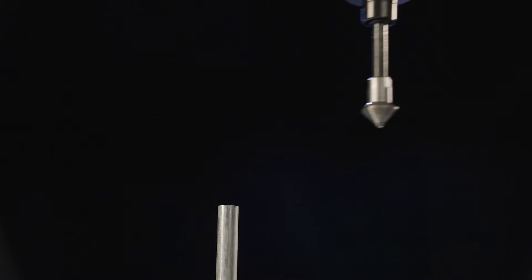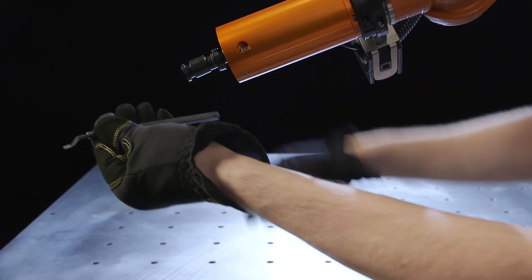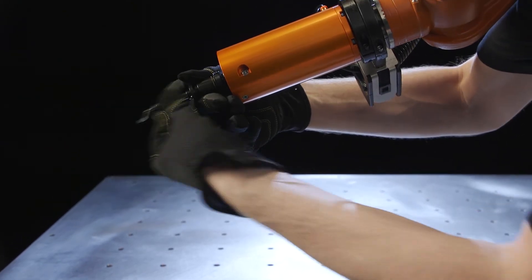How does it work? Off-the-shelf scraping and deburring media can be loaded into the CDB, enabling XY radial and Z compressive compliance. This means you can take cutting media out of your favorite tool holder and into your new robotic deburring cell.